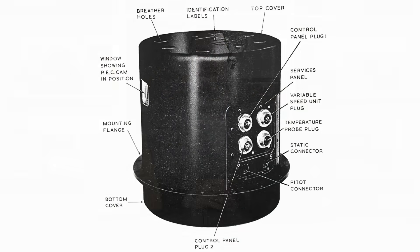In the early 1960s, the RAF started to replace the various versions of the AMU with something called a True Airspeed Unit, or TAU. This was designed to operate at the higher airspeeds being flown by jet aircraft, and it calculated true airspeed from Mach number and local speed of sound. To do this, it incorporated a very complex and very clever mechanical analog computer, and is thus far beyond the scope of this video — though if I ever get my hands on a TAU, I will definitely cover it in its own separate video.